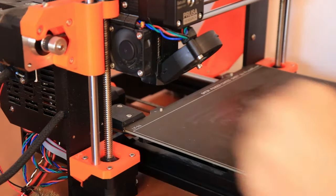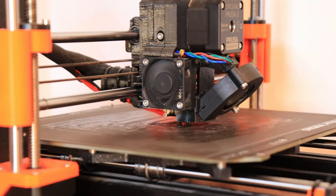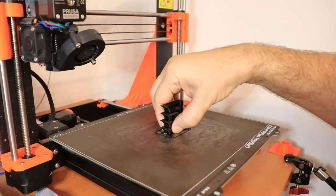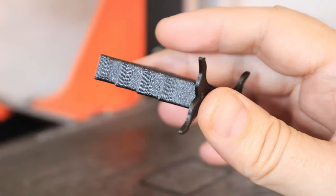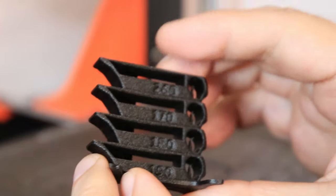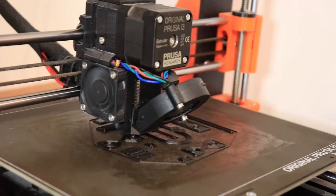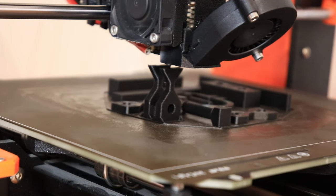Filament loaded without any problems. Testing the first layer and it looks great. The temperature tower will be from 290 down to 260 degrees Celsius. The bridging is perfect with this filament too. It's printed and the bed adhesion is great like with the previous filaments. Another perfect temperature tower — great overhang with zero cooling, fantastic bridges, no stringing, and all surfaces are great. This is the fourth batch of test objects already and it looks great. Now the last two elements for the layer adhesion test.